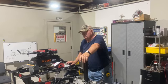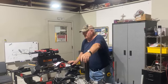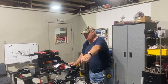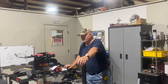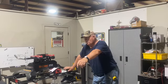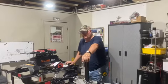I said, did you use your bars? Well, he said, of course. I said, what did it measure? There were 3 other experienced drivers there. They helped me hook it up, and he said that my truck's not level. I said, oh, that's the problem. I don't know how heavy it was, but it should never sit level. Your truck is 3-4 inches tail high. Oh, that's what I meant. It looked the same with the trailer on as with the trailer off. Okay.